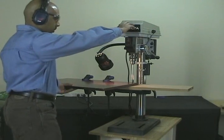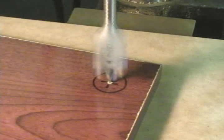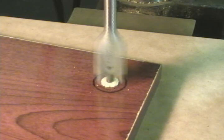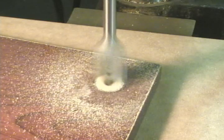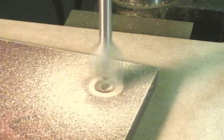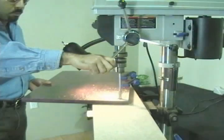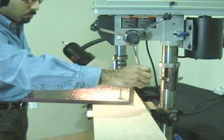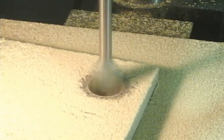I've clamped my shelf onto the extended platform that I've attached to the drill press. Line it up so that the tip of the drill will meet the intersecting lines of the crosshair. Use a steady force to guide the bit down and through the material. The drill press will get through the particle board with very little effort.